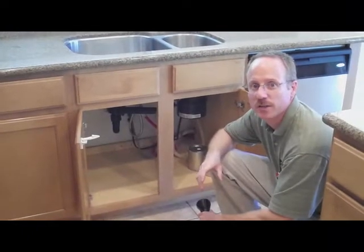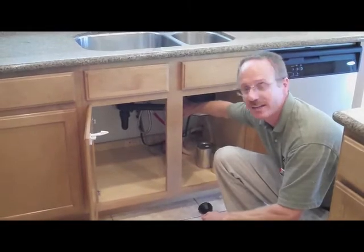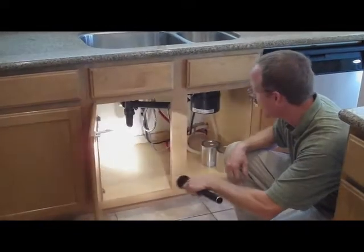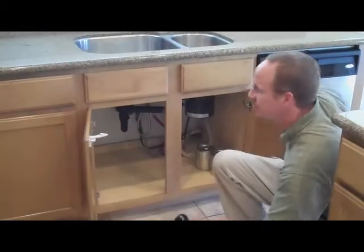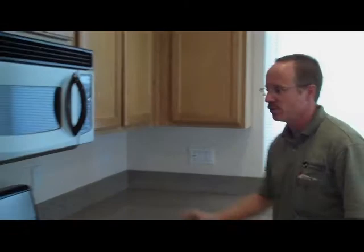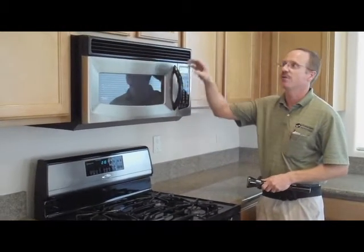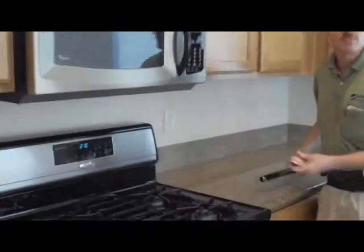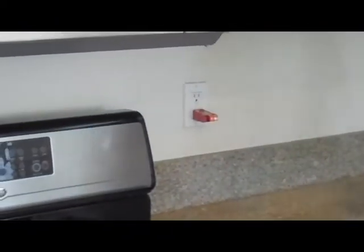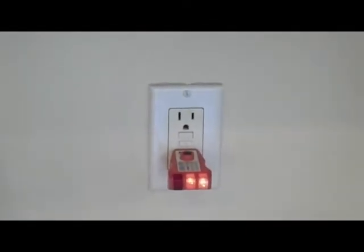In the interior of the house, we're going to check things in the kitchen like the garbage disposal, check the plumbing lines for any kind of leaks, and check the shelves for any past leaks or staining that indicates a possibility of mold damage. We'll check all the appliances, make sure they're properly operating, and see what type of vent the exhaust fan uses — whether it vents back into the house or through the exterior. We'll also check electrical safety issues; this house is equipped with GFIs, and we have testers to make sure they properly trip the breaker, then reset the GFI to confirm it's properly working.